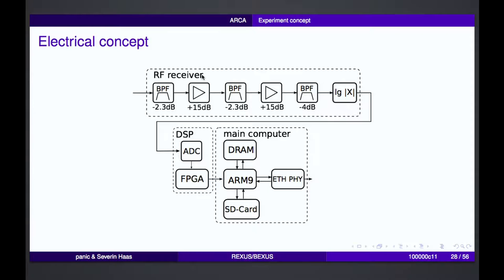Then we have a few other filters and amplifiers, and then we have a logarithmic detector. The data from the logarithmic detector is directly input into an ADC, an analog to digital converter. Then we do the signal processing in the FPGA, and the FPGA sends the decoded data via a serial connection to the ARM computer, where we can save it